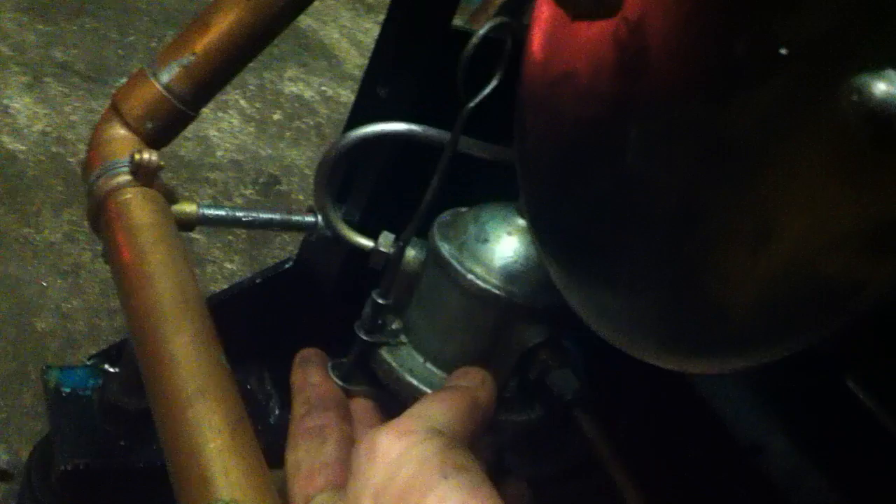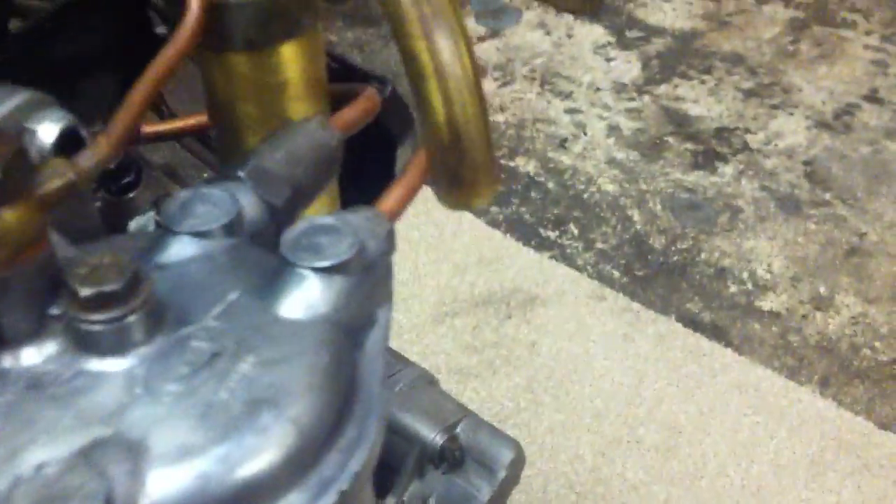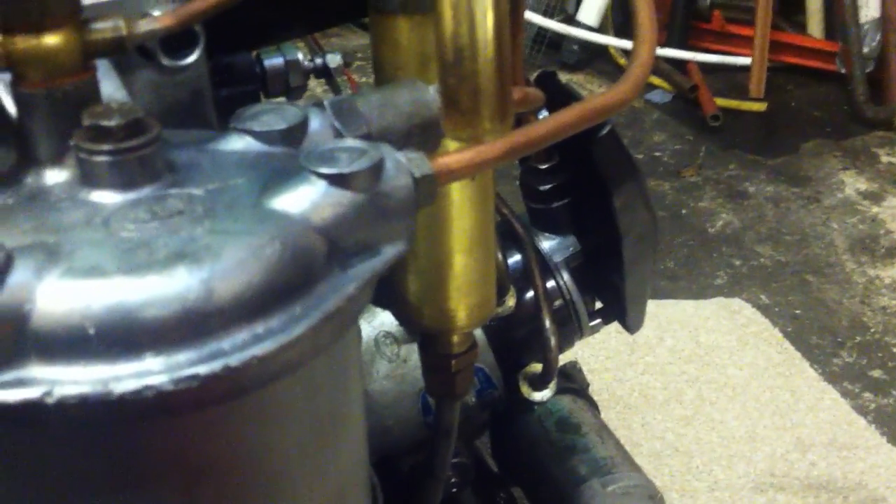To do it, you activate this here — you've also got the small pull knob if you wish to use that. First of all, just try and feel a good throw on the arm. If it seems tight and you've only got a small movement, you'll need to rotate the engine because the fuel pump cam may be holding it up. What you'll be looking for is fuel to come through. It'll first start to throw out a bit of fuel with some air bubbles, then the fuel will come through. Keep going a little while because quite often a huge bunch of air comes through afterwards.